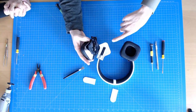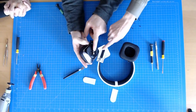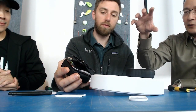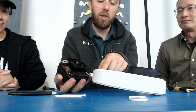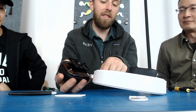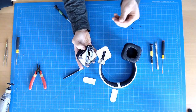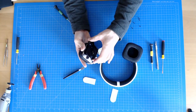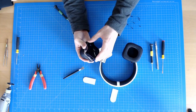Yeah, so there's a heat-treated spring steel that creates a little detent, and it slides on a track that has bumps in it. So every 3 millimeters or so, you get a little detent to give you that range of motion. What's really cool is that we have this material here with those 3 millimeter gaps on it. There's some lube on it to help it slide, but this is almost freestanding and sliding because we have degrees of freedom, I guess, just in one axis here,